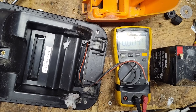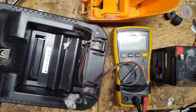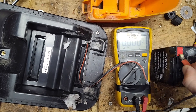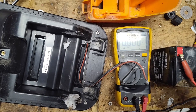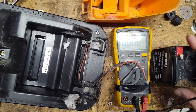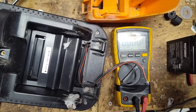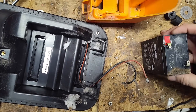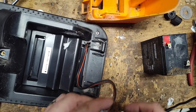I've got a load deal here on my power supply. I'll set it to around 7.2 volts and hook that across the positive and negative of the battery to look at my amp gauge. Right at 0.1 amp draw, so it's pretty well charged. It's reading like really close to 6 volts. If the battery were bad, it would load down my power supply more, but it's not — because we're putting 7.2 volts on a 6-volt battery that's at 6.5 volts max; it's not going to climb a whole lot higher.